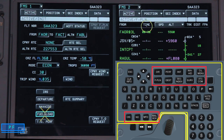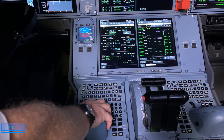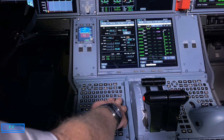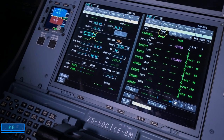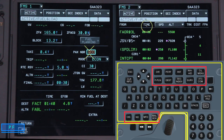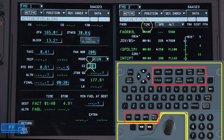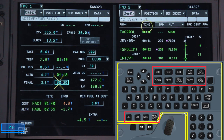Returning to fuel load, we click on fuel load and enter the zero fuel weight of 165 tons and ZFW CG. If we haven't received the final load sheet, we can insert a provisional CG of 30. Block fuel shows 13.2 tons; we can amend taxi fuel depending on taxi length. Number of passengers — if we have the preliminary load sheet, we can enter 200. We can adjust the route reserve to 600 kg. The cost index is shown, along with our final 30-minute fuel, alternate fuel, and we leave gross weight jettison blank. At the moment we have insufficient fuel shown for the flight.